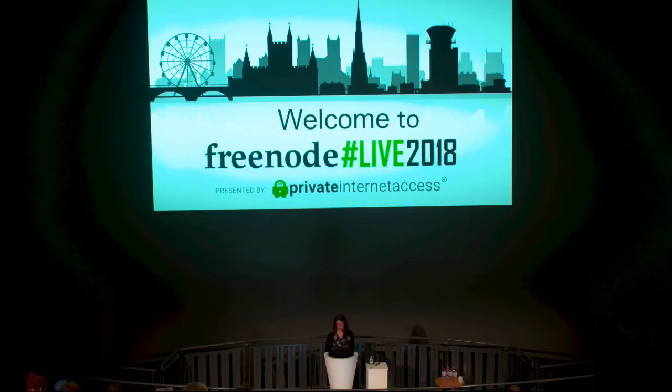We also have utilities from coreboot itself — coreboot provides its own GCC toolchain, for instance. Moving to some brief history about the coreboot project: coreboot provides hardware initialization on various systems — laptops, desktops, and servers. It started in 1999 as a project called LinuxBIOS. The idea was that around 1999–2000, hardware started to become self-describing. In the old days you had a BIOS providing an abstraction layer for your operating system.